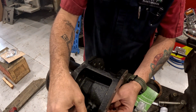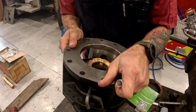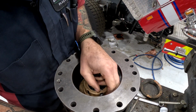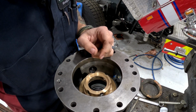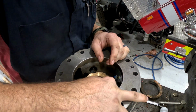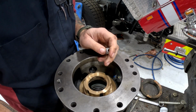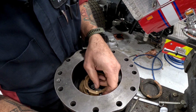Okay, if I'm not mistaken, I believe there's only one hole that you can put the locking pin in for the adjuster ring sleeve. So if that's the case, I'll have to double check, but you'll want to install the locking pin for the bird cage on the opposite side of the pin for the sleeve. And then you shouldn't be able to mess up your clocking of the bearing housing. This is gonna fit in here like that, and then push through and then snap into that groove spot. In theory.